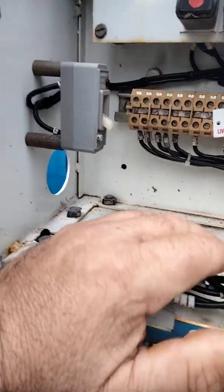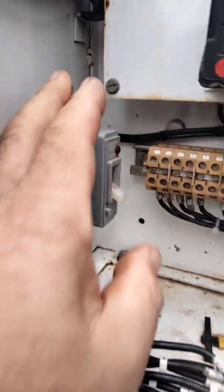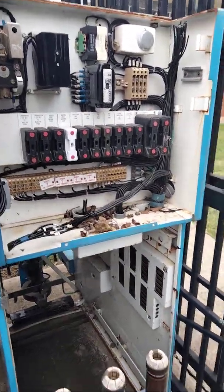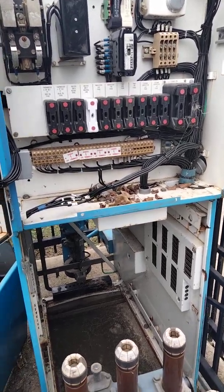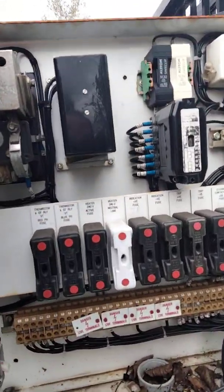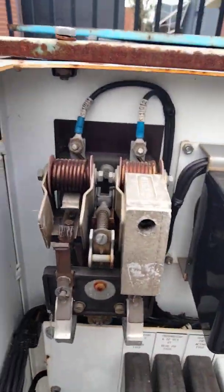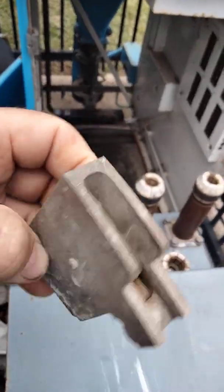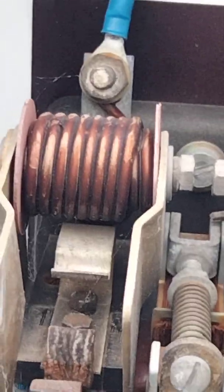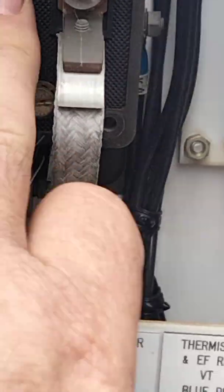These are all pre-wired, basically an old main switch isolator — nice and simple, turn it on, turn it off. I'll do more videos next week on some of the high voltage breakers we use out in the street. These have the old arc chutes in them — when you pull them out you can see the contacts. They're like a DC contact, made out of ceramic. When you look at the contact inside, we've got the closing contact sitting inside there, and they've got a spring coil on the back that helps hold the tension on it. The coil sits straight underneath and just closes in and out.